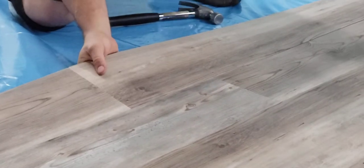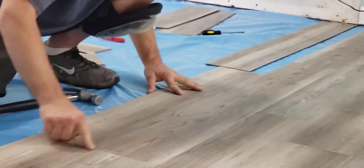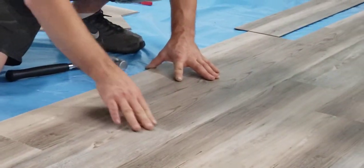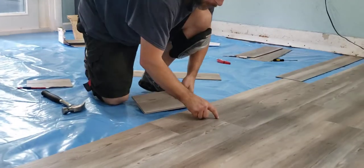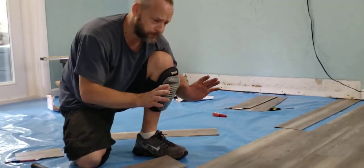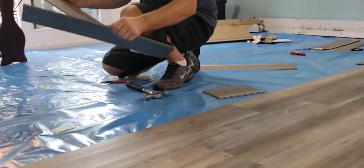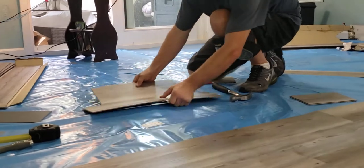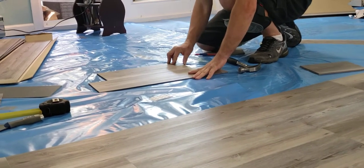Watch it as you go down — make sure the seam is tight. Sometimes where there's a staggered spot it'll be a little off. Take the time to make sure you don't see any gaps. This is vinyl floor — this particular Tranquility brand, I don't know if this is mid-grade or whatever, but I've noticed they're doing this even on flat pieces: I put two pieces together with no pressure and lock it in, but there's a gap in the middle. I push hard, watch it, and with light movement it's coming out.